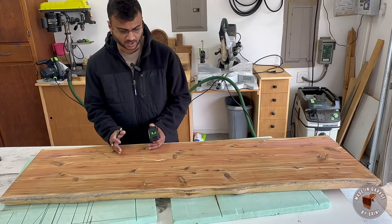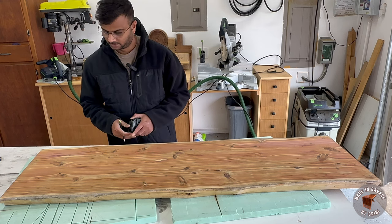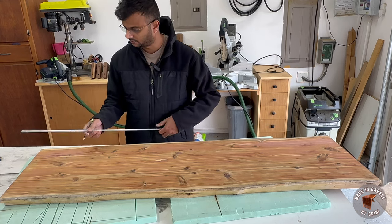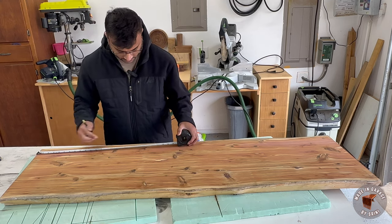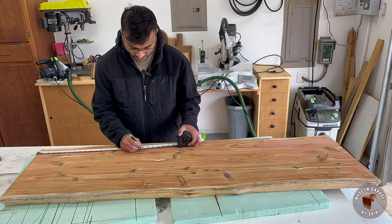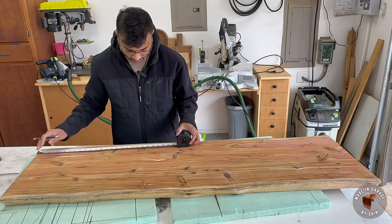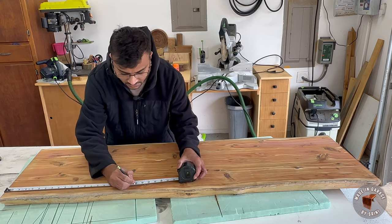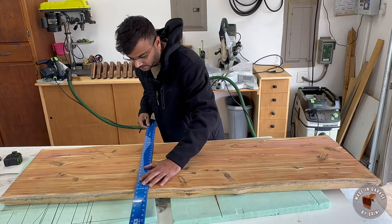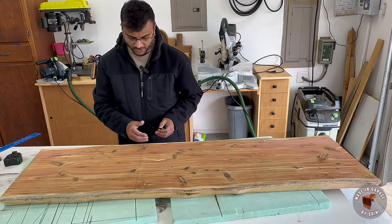When I make the bench I want it to be at least 20 inches above the ground. This side will have the waterfall leg, so I'll measure 20 inches. The standard height is between 18 and 20 inches, so I'm taking 20 in case I make any mistake on the miter cut — I'll have 2 inches of room. I'm marking 20-inch marks on both sides and using a drywall square to draw a line joining them. This is the place where I need to cut the miter.